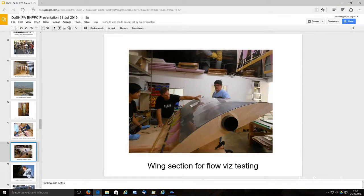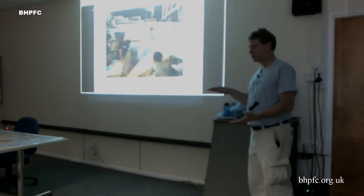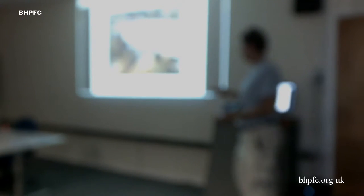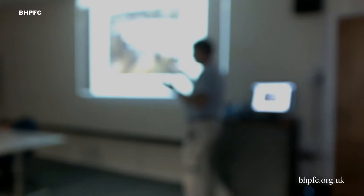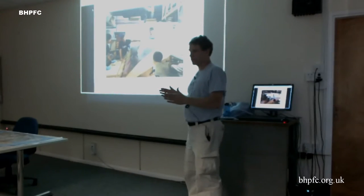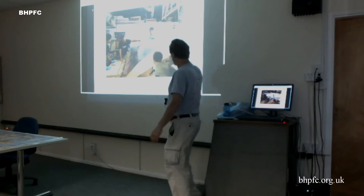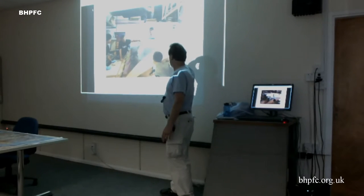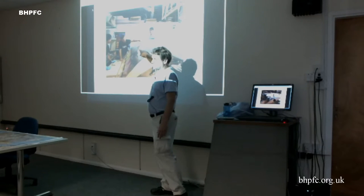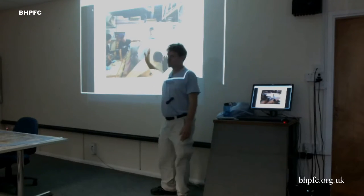So, I mentioned that we have this adhesive-backed mylar called Duralar that's 2/1000ths of an inch thick, instead of 0.5 thousandths on the front, in order to make sure we have laminar flow. But every 350 centimeters, it adds another 2/3 of a kilogram to the airplane. And so we had a notion that at some point the laminar boundary layer is going to get thick enough that it's not going to transition at that lip and we can get rid of some of that weight.